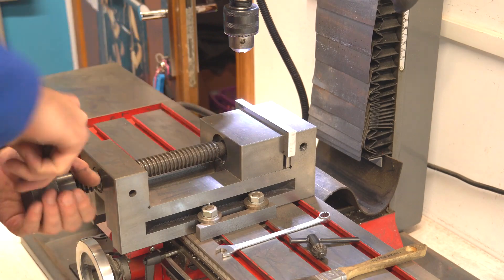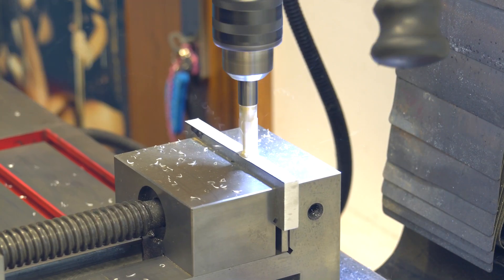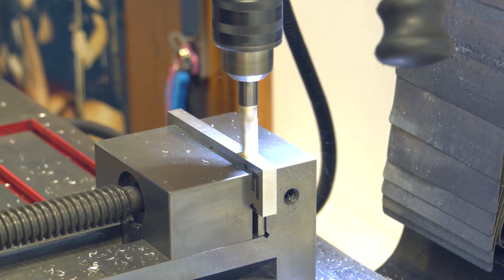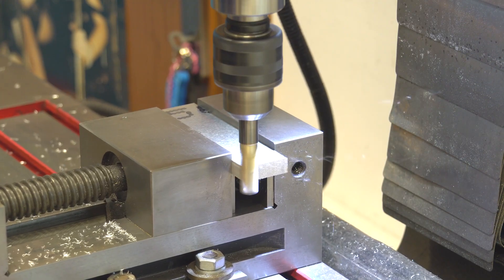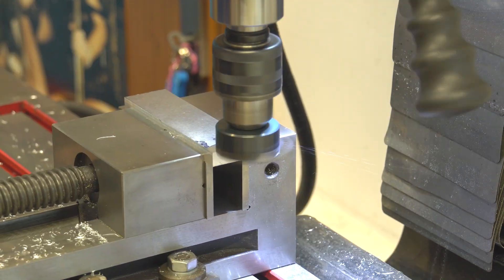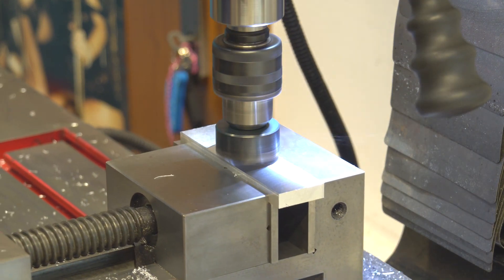Now prepare the milling machine and mill the piece all around from all six sides to get a nice finished piece. When turning the piece around, always cut the edges or the vice will squeeze it and the part will deform. For the top and bottom surface I will align with a homemade fly cutter which works just great.